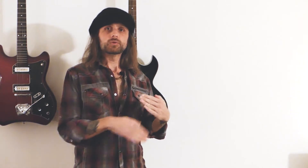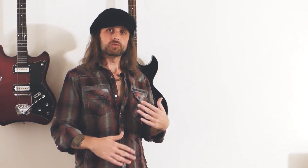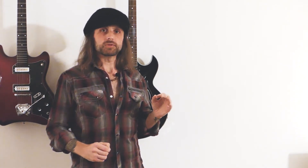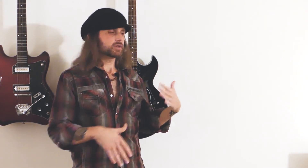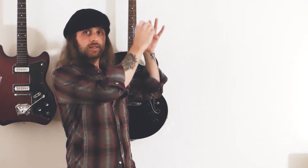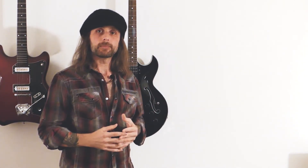Another thing — we talk about shielding. Just like that cable is shielded with a mesh that goes to ground to suck out the noise into the black hole, if you think about certain guitars that have pickguards on them — like Strat style guitars — people will say that you can shield them with copper tape and shield the pickguard to block noise out from the electronics. Well, same thing. That's only going to work if that shield is actually grounded properly. That metal or copper tape is collecting this ambient noise and then sending it to ground so you don't hear it.